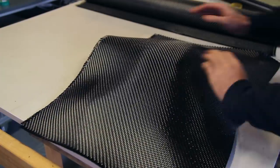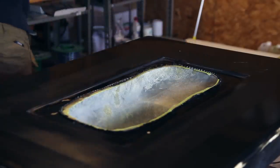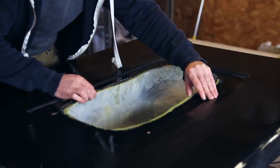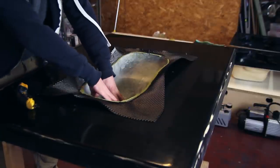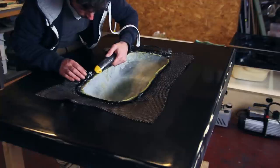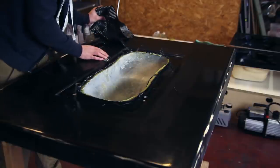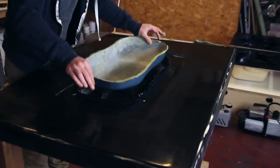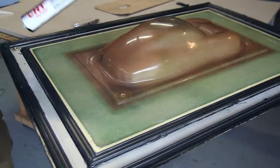We start with two plies of 650 gram per square meter twill weave carbon fiber. The measurements were 0.75 meter by 1 meter, so I know exactly how much fiber went in. That's also why I save the off-cuts — later in the video I'll do the calculation of resin-to-fiber ratio with this new RTM technique. It's very important to cut the fibers as close as possible to the inner side of the molds, because there will be a resin perimeter around that to infuse the part.